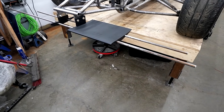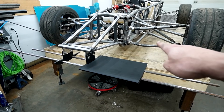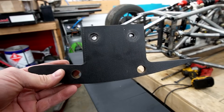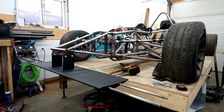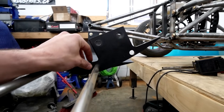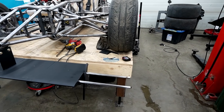I did goof up a little bit - these are supposed to be 80 millimeters lower, because the wing is supposed to be level with the bottom of the cart. The bottom of the cart is 90 millimeters off the ground. Each one of these airfoils takes about 10 to 12 hours to print for 250 millimeters, and I need to make probably six or seven of these. We swapped out these plates - they drop down 80 millimeters lower, so now the wing sits 80 millimeters off the ground. We're printing out a bunch of pieces and we're going to be putting a second element in too, with an adjustable slotted attachment.